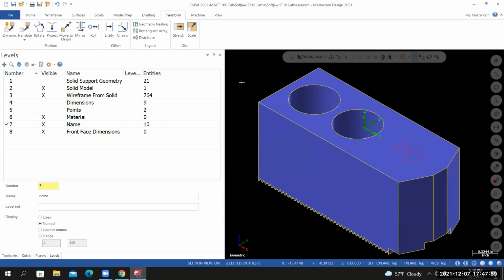You go to transform, translate. And then I use the reselect under start from. If I go to transform, reselect. Okay, and then you're going to select the center point of the initial, and then select the midpoint of that construction line. And I use the method move. That way I don't got to go back in and delete the original. Got it? Yep. Perfect. Thanks. Hey, you're welcome.